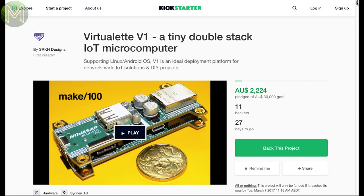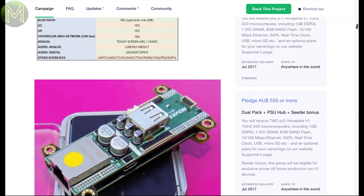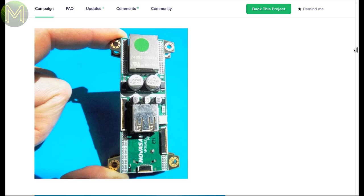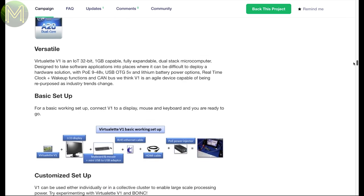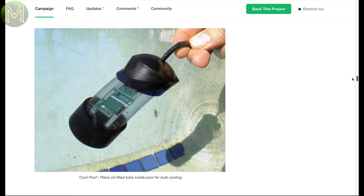Virtualet is a small SBC-type board based on the Allwinner A20 MCU. It comes with 8GB NAND flash, 1GB DDR3 RAM, RTC, 100MB Ethernet, SATA, HDMI, USB, and SD. It can be powered from either USB, battery, or power over Ethernet, which is unusual. It's a very tempting board, except for the price tag — $285 Australian dollars is a lot, and I'd have to have a very specific need for this one.